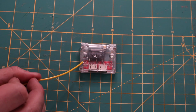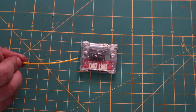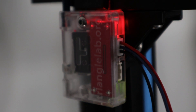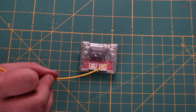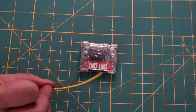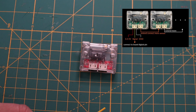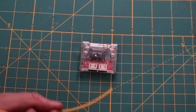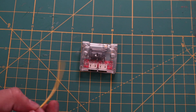We also have two LEDs located on either side. One LED is a green one, which shows if the unit is powered up, and the other one flashes red when your filament runs out. So you get a nice visual indication if you run out of filament in addition to your printer knowing. You've got two connectors at the bottom — it's implied that you can daisy-chain the connectors. So if you have a multi-filament machine or multiple extruders, you can daisy-chain these together, and any single failure will cause the machine to pause itself.